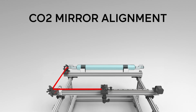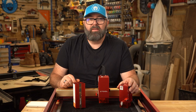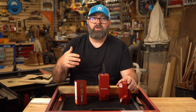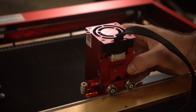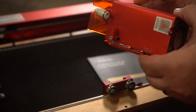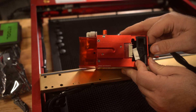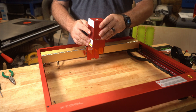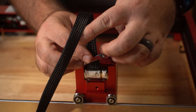The struggle with some CO2 lasers is the way the laser beam transfers from the laser tube to the surface — it travels through a series of mirrors that have to be perfectly aligned. If you're new to lasers, aligning these mirrors on a CO2 can be time-consuming and frustrating. Focus for diode lasers is pretty easy. Changing from the 10 watt to a 20 watt module, or from the 20 to the 40 watt module, is pretty simple — you unplug the module, remove it from the gantry, replace it, and plug it back in.